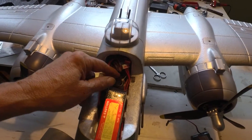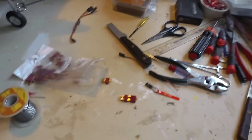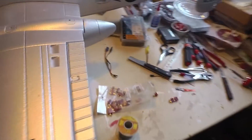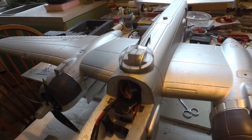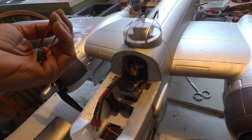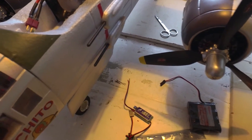The simple solution was either an external receiver battery or what I'm doing right now - making a little pass-through connector. I've got a UBEC here that's going to go in. It's inexpensive but it's got plenty enough power - five volts, three amps - for the four or five servos on this airplane including the tail gear and landing gear. I'm going to solder that in and when we come back I'll show you the working airplane.